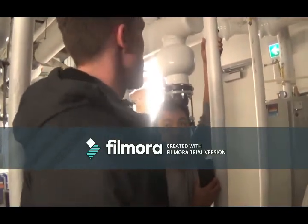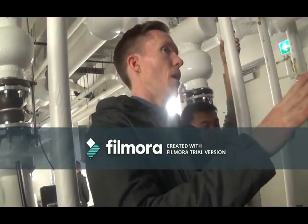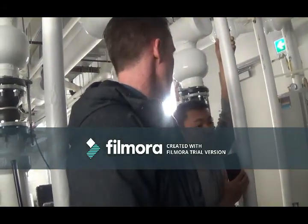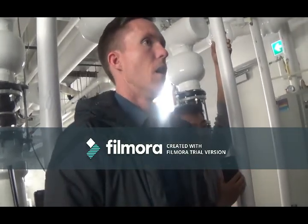And in the shoulder months you'll get close to that, unless this is a primary loop system. Yeah, it is. And when I say primary loop, they'll have a minimum temperature, probably around 160, to make sure your domestic hot water indirectly gets the amount of heat it needs.